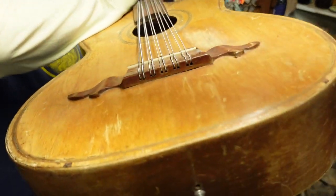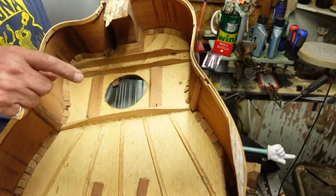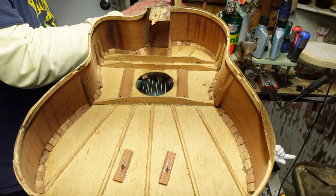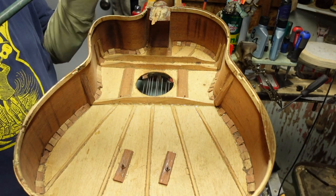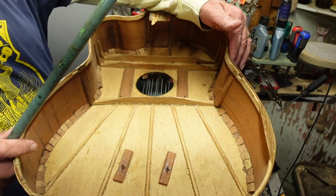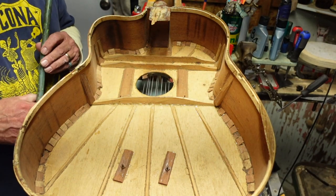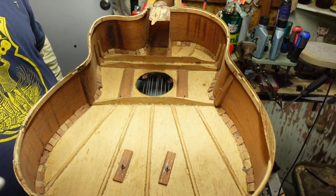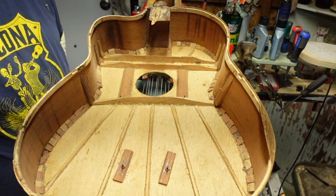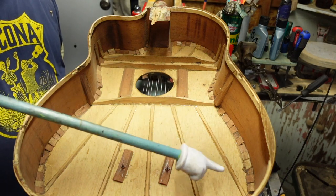Before we move on, I want to show you that this side of the body of the guitar - the sides bow out here. That problem has a lot to do with the fact that this brace right here is actually sitting on top of this side brace, so regardless of what I try to do to bring this in, it will not let that sit. So we're going to take that off. I want you to notice this bracing pattern - I'm going to put in a picture of a bracing pattern. You're going to get a couple seconds of silence. Notice this, this, this, and this - fan bracing.